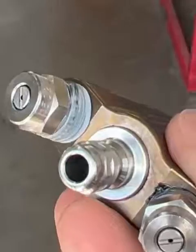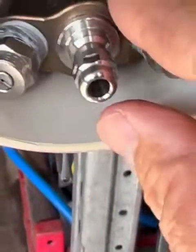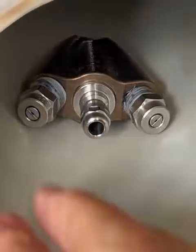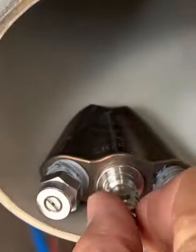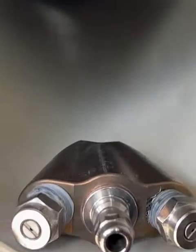It's got heaves of thrust — that front jet, as you saw, has plenty of cutting power. Inside a pipe, we set those angles and it'll just go through and drag out all that silt. Flick it over as you're working it and it'll run up and back, dragging all the silty stuff out, cutting roots and lifting behind the sidewalls and everything.